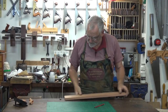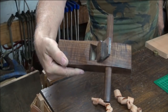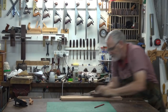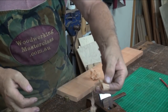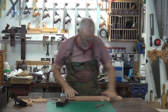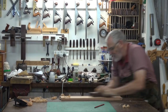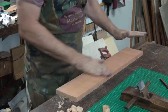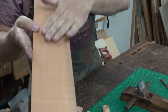You're going to have those machine marks there. So it's good to learn how to use a hand plane. If you get a smoothing plane — in this case this is an H&T Gordon smoothing plane, but a Stanley Bailey would work just as fine. You can actually see the machining marks coming off of there. Now they were barely visible to the human eye, but I can guarantee once you put a finish on they will definitely show up. They're not thick shavings, but that surface is so nice and also has a sheen on it, which the hand plane does.